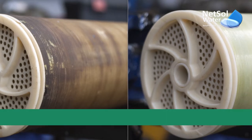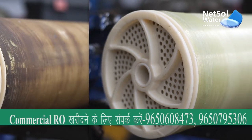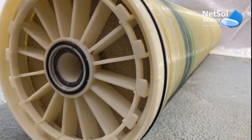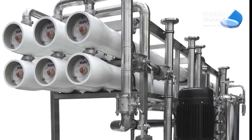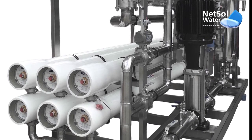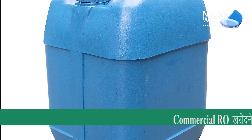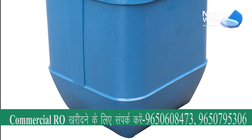It may become compacted in the membrane. The third stage: the RO membrane cleaning should be done in stages to achieve cleanliness more properly. If the first stage parts are cleaned at ideal flow velocity, this will result in membrane telescoping in the second stage. Alternatively, basing the flow velocity on the second stage might result in insufficient surface cleaning of the first stage membranes. The last step is very important as the cleaning takes place through chemicals — a step-by-step guide I'm going to tell you about.